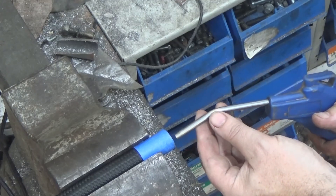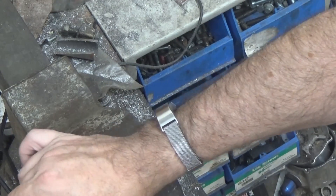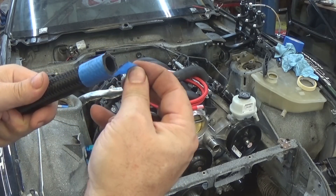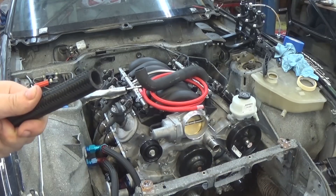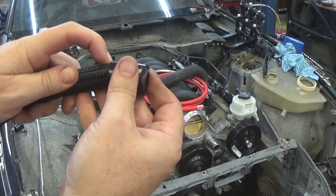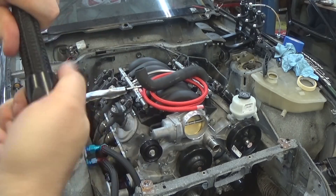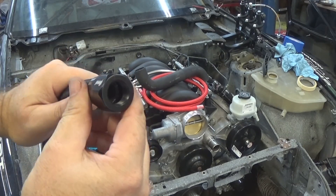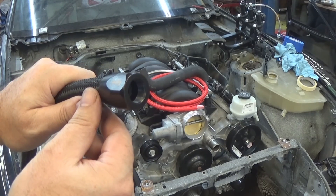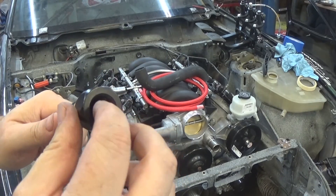I'll blow all the rubber sawdust away and make sure it's cleaned out. Now it's ready for the fitting. First I peel off the tape, pulling it at a slight angle so it doesn't cause any extra fraying. Then I take my hose end and make sure all of the little threads tuck into it. I twist and push it into place, making sure the bottom of the hose is flush with the start of the threads on the inside. There we go — the hose is coming all the way up to the bottom of the threads.